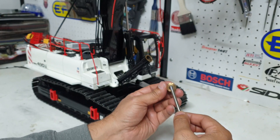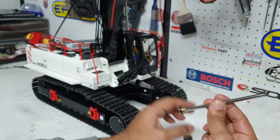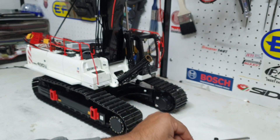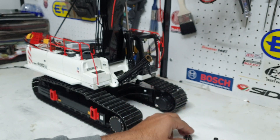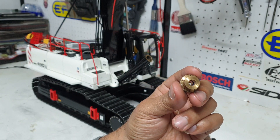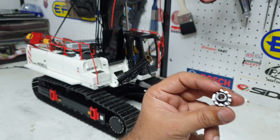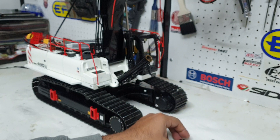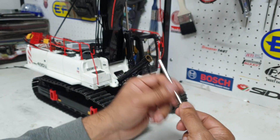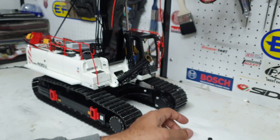That's pretty much it — the cheapest and the fastest way rather than buying a new cylinder if your piston is leaking. Now, if it's leaking a lot and your finish is pretty good, clearly your O-ring inside is damaged, which means you need to replace the O-ring. But if you've got scars, marks, or swirls on your piston rod, you really need to finish that off completely, and then you won't have a leak.